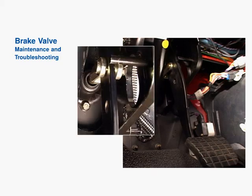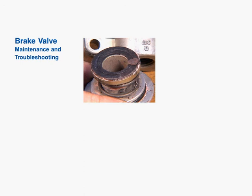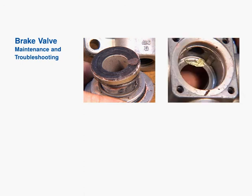In suspended types, make sure that the linkage is not worn or bent. Another problem is the presence of contaminants like rust, and even the use of Teflon tape. If used on fittings and improperly placed or trimmed, pieces of tape can break up, enter the system, and cause valve seats to leak.